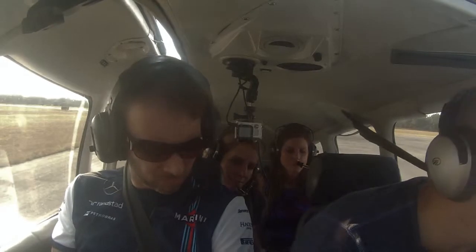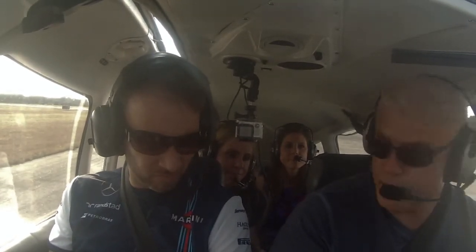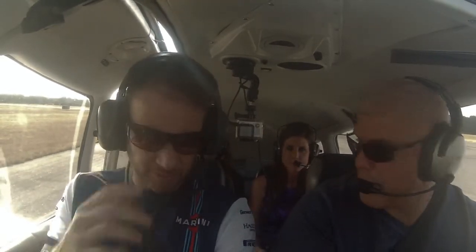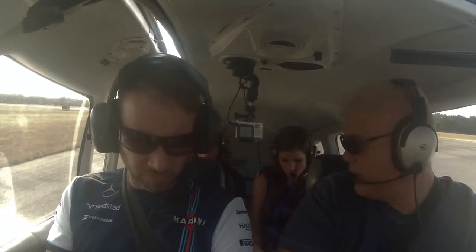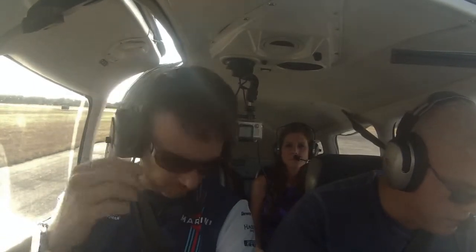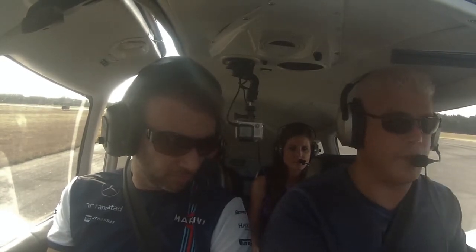Static source is normal. Okay, seats, make sure you go like this, make sure you're not sliding around. Yeah, locked. Okay, your seat back is okay. Belts, and everybody's belt, we're good. We just have this one, right? Yep, that's it. Okay. Flaps, we're not going to use any flaps. Trim tab is neutral. All right, going to check the controls.